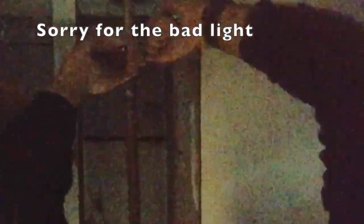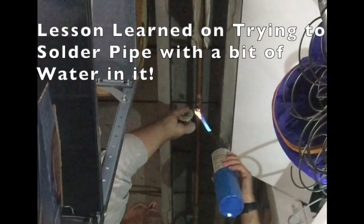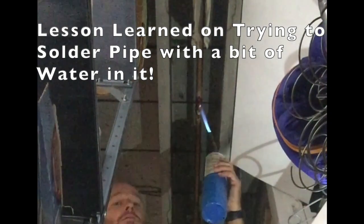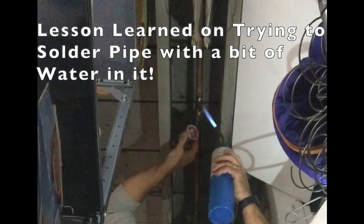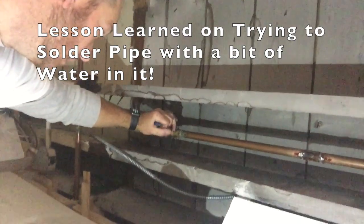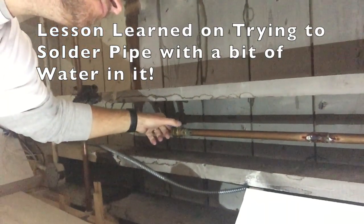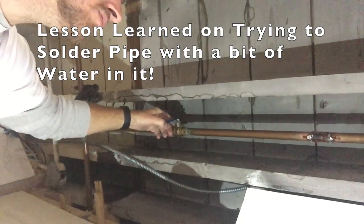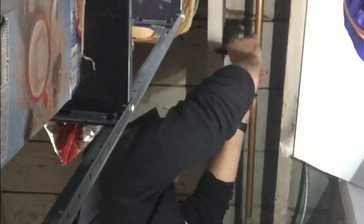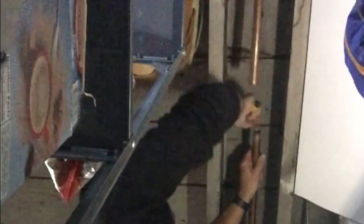Once this was tightened in, I was ready to connect the two pipes again. My first attempt was to solder it. I've soldered before plenty of times, but it had been five or six years, and I was having a heck of a time getting the flux to suck the solder in. It turns out the ball valve was actually leaking a little bit, which caused this problem — once I finally got it soldered together, it leaked everywhere. Lesson learned: don't try to solder when there is water running through the pipe. I'll link some videos in the description with suggestions on how to deal with this.